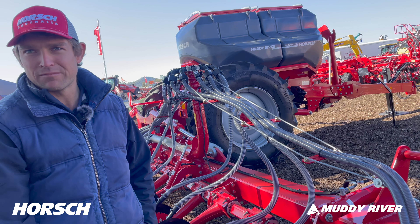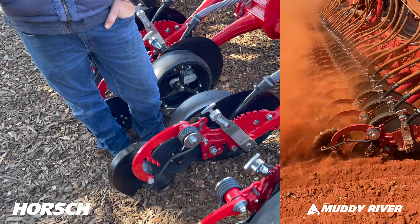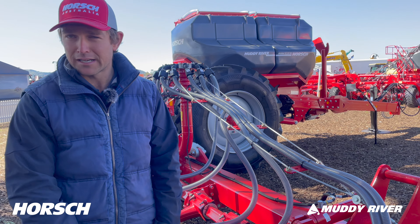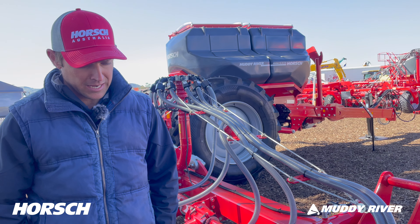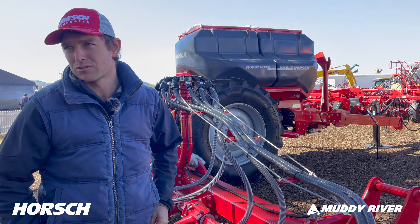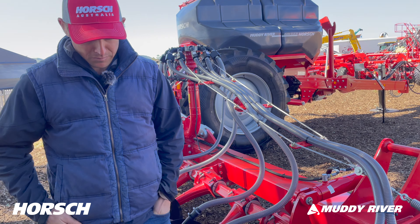Very little disturbance. We've gone with a tooth wheel on the back and we're actually finding we can dig dirt out of the furrow — if we don't want the seed too deep we can offset it to the plant line and fold that furrow closed. We're finding it very, very reliable, very accurate seed placement. Not having diffusers — we thought initially that would be an issue for setting fan speed — but we haven't had any issues at all. The simplicity is amazing. Setting depth, press closing wheel, and press wheel is very, very easy.